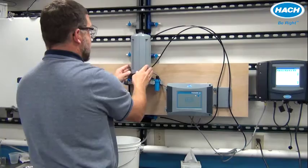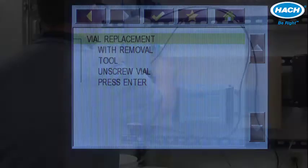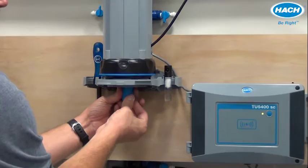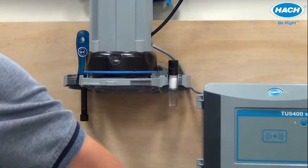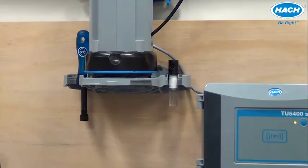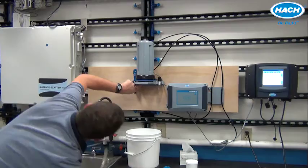Continue by pressing the enter key. We're instructed to remove the vial with the vial removal tool — seat the tool onto the outside of the vial and unscrew it to remove the old vial. Catch the small amount of excess water with a bucket. Remove the old vial and set it aside. Check inside to make sure the O-ring is still seated — sometimes it comes out with the vial, but here it stayed seated, which is fine.